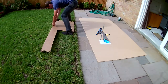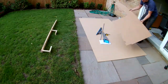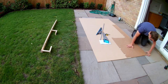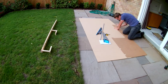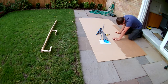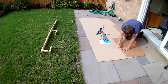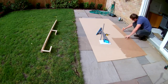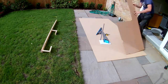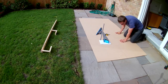Once I'd drawn the basic outline, I removed the hardboard from the frame again just by undoing the screws. I could then lay the old front over the outline of the new one to make sure that they lined up. I knew that the old one was the right shape, so this was a nice way to check that my measurements were about right. It fitted well, but it did remind me about the extra details that needed to be removed, so I noted them down to check more carefully later. I also marked where all the screws had gone through the board so I could use the same holes in the frame for the new front piece. Finally, I drew circles around all these dots so I could tell the difference between a hole mark and random dirt on the board.